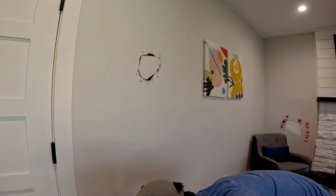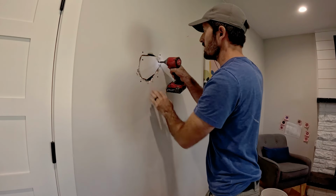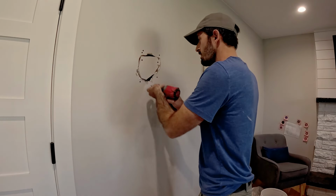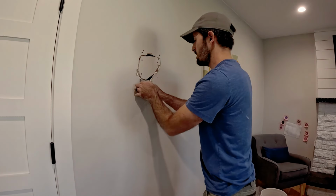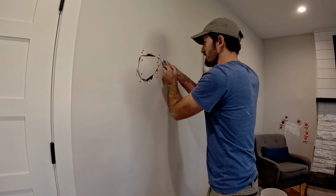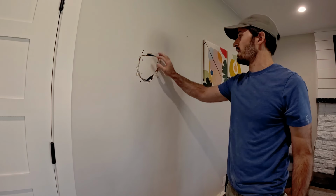Okay, a couple more screws. I'll put 4 more screws in here. 3 at least. This top piece came loose over here. There we go. Your drywall is reinstalled, re-secured. Don't worry about these gaps as long as they're not giant. If they're bigger than 1 inch, you probably should have a little bit more drywall in there, but if it's in a spot that's not going to be getting any weight put on it, or something installed like a TV, that would be kind of a problem to have some dead space, but for what we're doing, not a big deal.